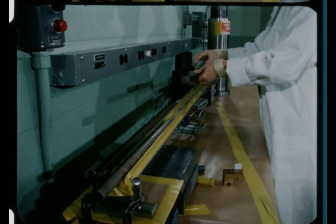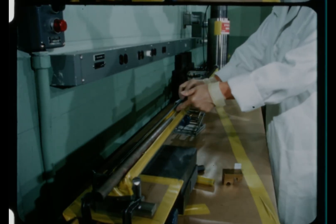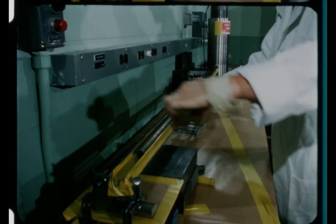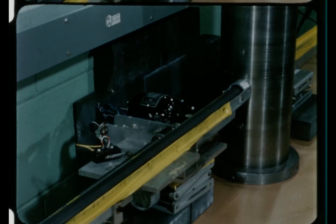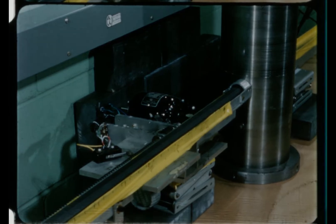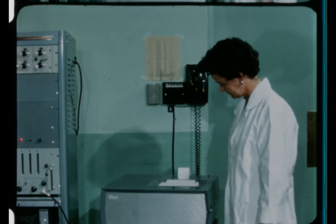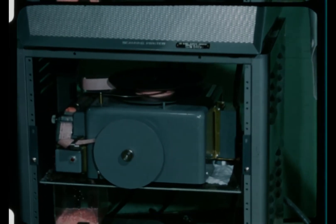To measure fuel element corrosion, the Los Alamos Scientific Laboratory developed a new inspection technique known as MULE, an acronym for Mass Per Unit Length Examination. During this inspection, the fuel element is passed through a gamma beam from a cobalt-60 source. Measurements of the intensity of the beam transmitted by the element are taken every inch over its entire length and recorded for later comparison with similar measurements made during the post-mortem analysis.